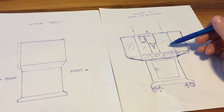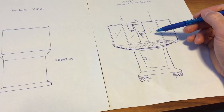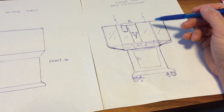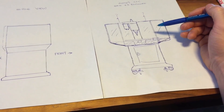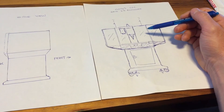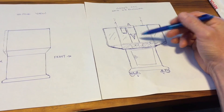If you buy acrylic, also known as plexiglass, it's brittle and it cracks and not that great to work with. Acrylic is harder though, so you can wipe it down without scratching it as easily. If I can create this whole thing without having to drill any holes, I might do acrylic for that reason. But for now I'm leaning towards polycarbonate so I can drill holes for hinges, magnets, or whatever I'm going to do for the door.